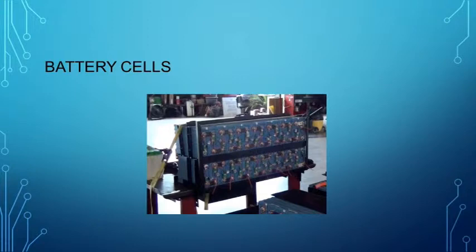This picture is the front of a battery box ready to be installed in a vehicle. Notice the small microprocessor board on each individual cell. Each board is attached at the negative cell terminal and connected to the positive cell terminal to monitor individual cell voltage. The BMS boards are also attached in series to the adjacent board and eventually to the BMS computer.